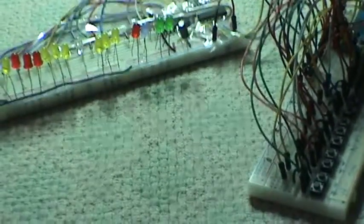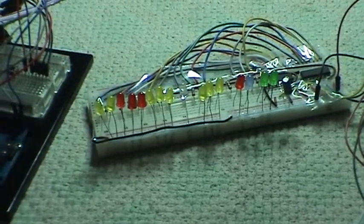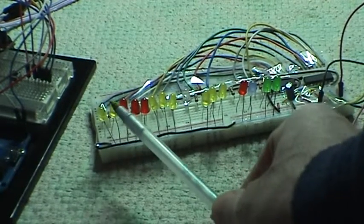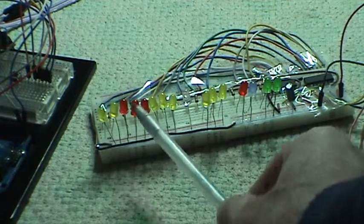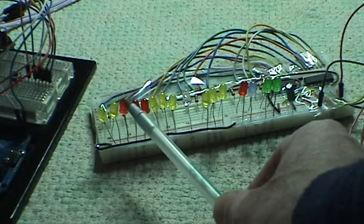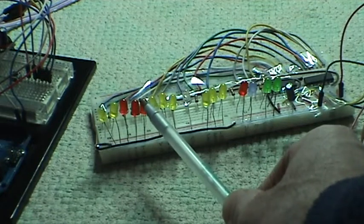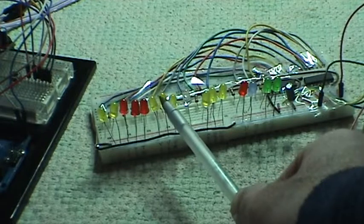Over here, if we go back now, we can see the LEDs. These LEDs represent various things. The first one is the connection, so if it's connected to the Bluetooth module, then we have power. Then we have the tone settings. This is in binary with the most significant bit first. So in other words, this represents 4, 2, and 1. So if they were all lit, we'd have a level 7. The valid values are 0 to 5. The same for volume, 0 to 5.